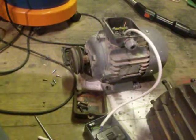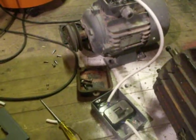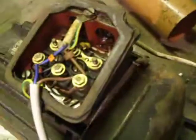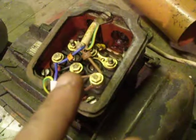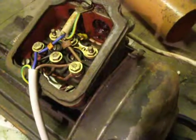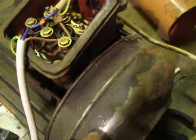Okay, there we go folks — how did I do it? It's very simple. All you're doing is — I'll do a bit of math. If I put a capacitor between the live wire and the one I don't use, it's 50 microfarads for one horsepower. So to correct the extra phase shift, in this case, this is a 2 horsepower motor, so I'll need a 100 microfarad capacitor to create the phase shift, so this one would then start up.